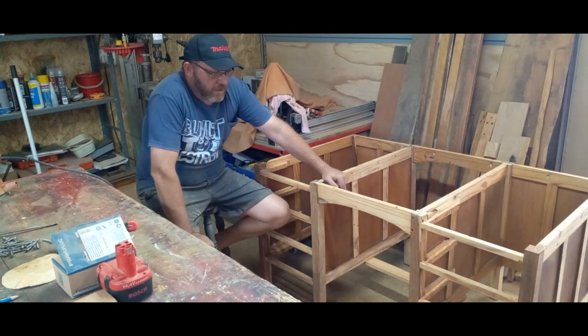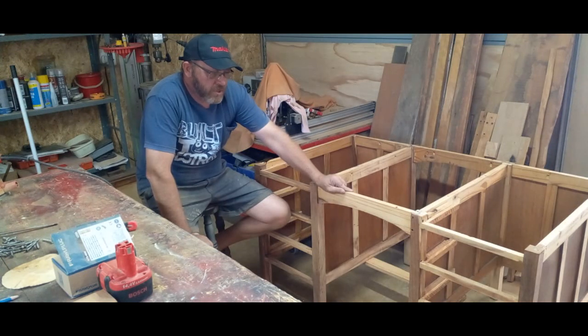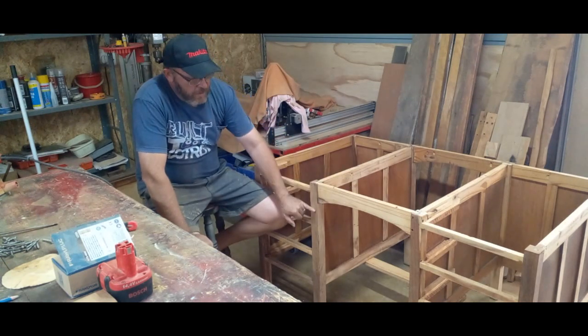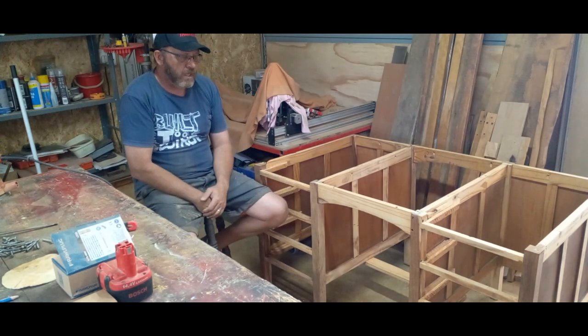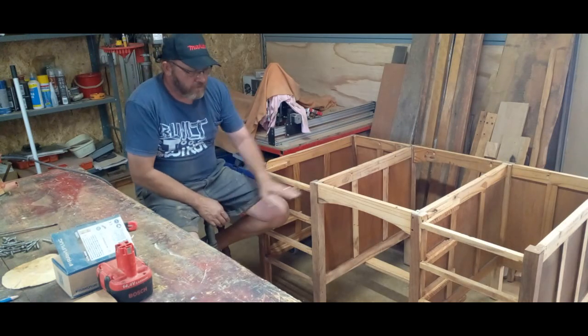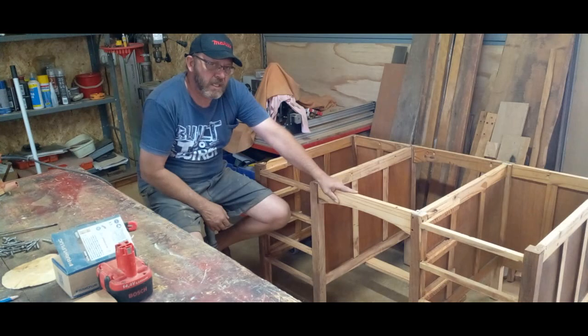So what I've decided to do is to stain all the lighter wood just a little bit darker, not much, because the top is also from Kiat, but it's got lots of whites in. I'll show you a picture after I sanded it. And so by just adding a bit of darker color to the pine, I think we're going to get a very nice effect.